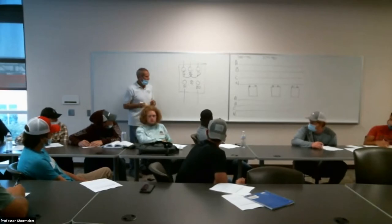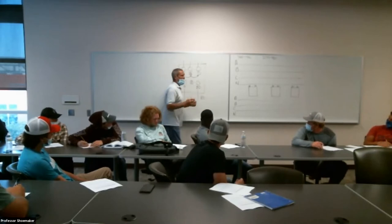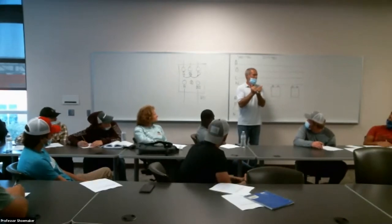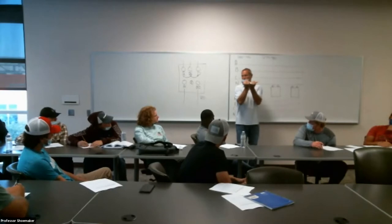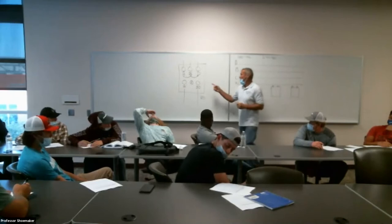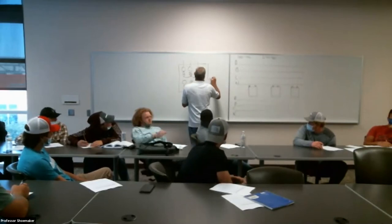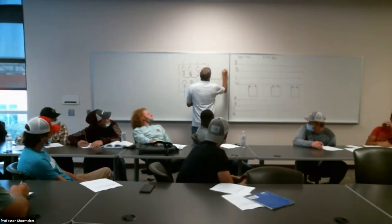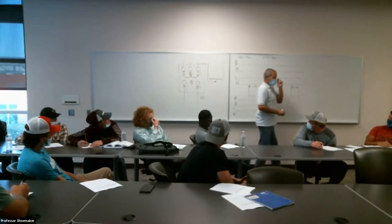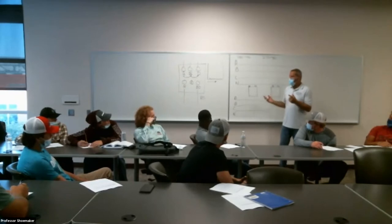So, congratulations. Remember when we did the class part where we did how do I get 240 out of a transformer? What was the answer? Alternating directions. Opposing directions, right? When I take the AC and BD, put them together, the coil goes like this. This is on the secondary side. How many directions does it go? Only one. So I don't have opposing directions anymore. So I make it all one voltage.